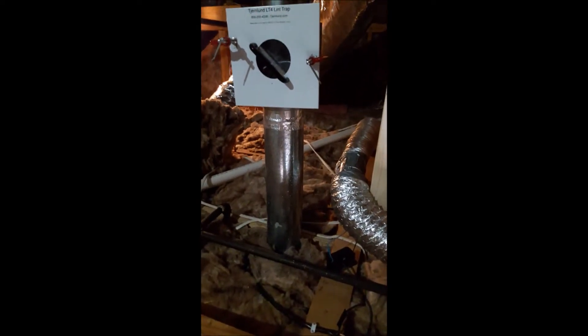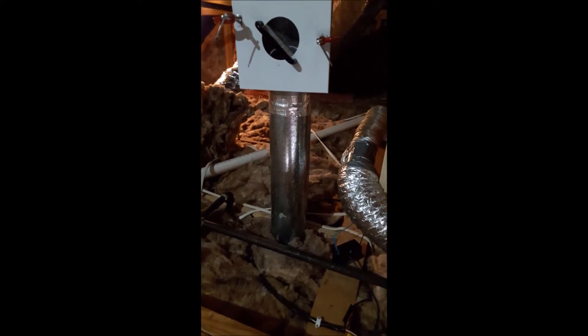You could just do a fresh air intake that's not powered with a fan, and I think you would see that your dust levels would drop a lot. The makeup air for this dryer has to come from somewhere, and if your household doesn't open doors and windows, that somewhere is from the cracks in the walls and in your HVAC inlets and outlets in the ceiling. That's why you're getting dust. I'm making another video about the fresh air intake for the whole AC system and will cover that in a lot more detail.